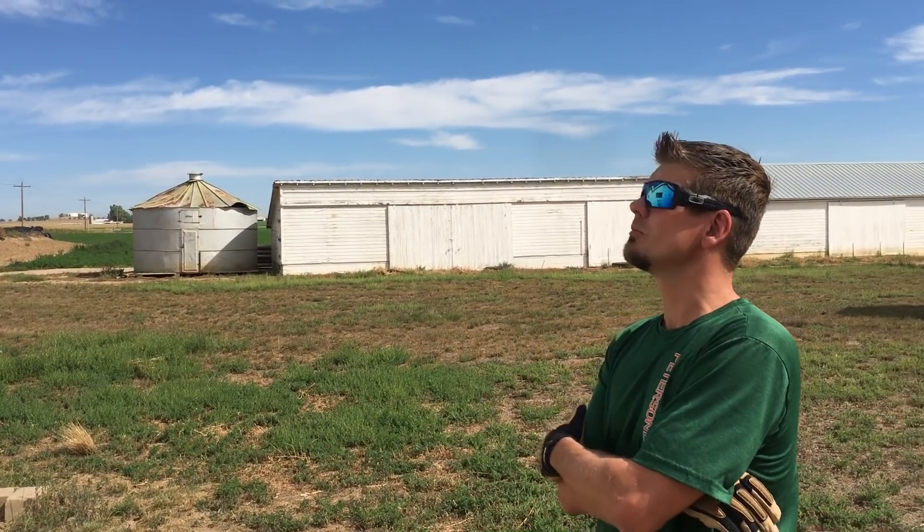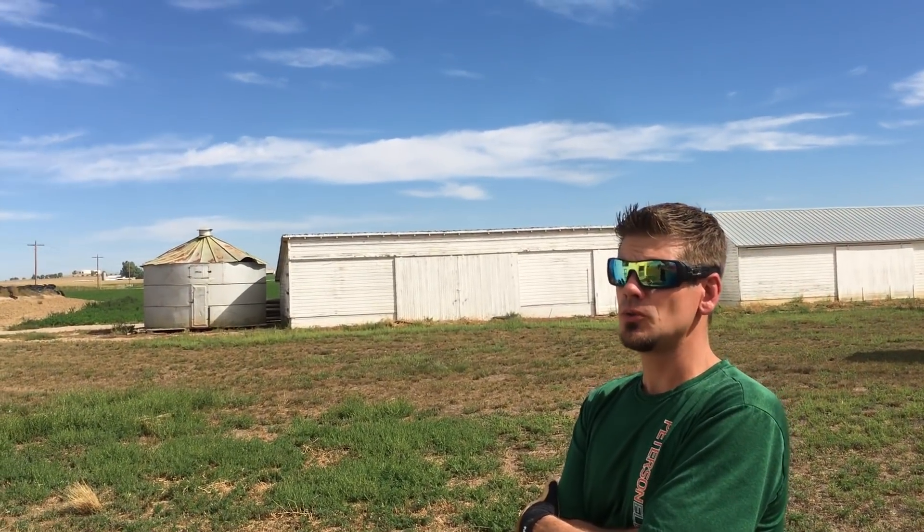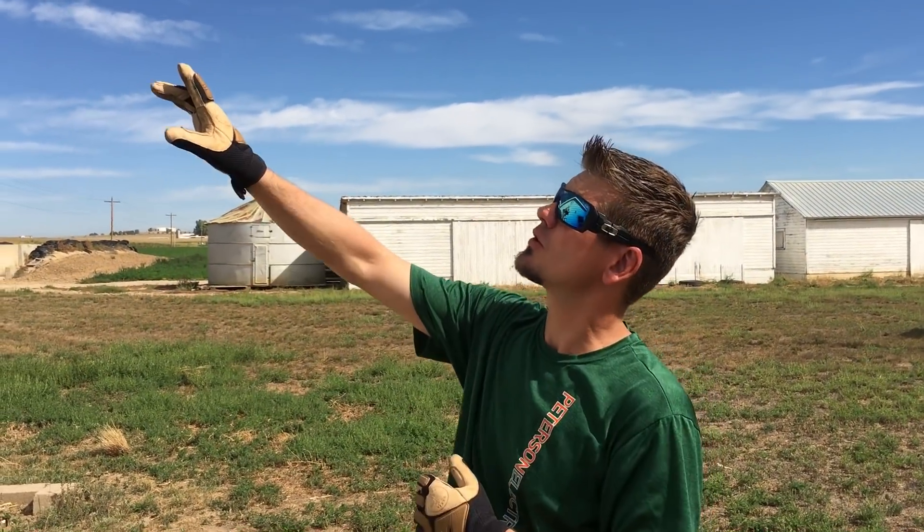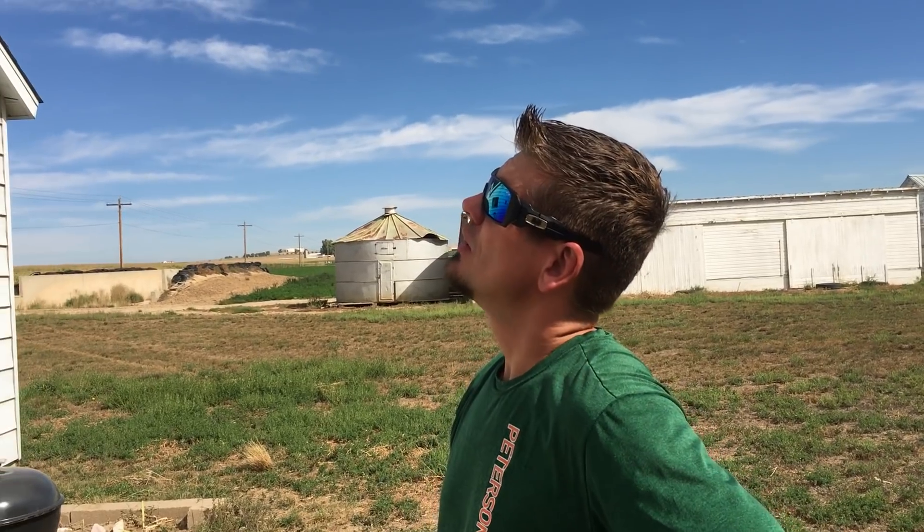So right here on the side of this house, we've got to figure out what to do. My suggestion for this gentleman is to probably do a total gut — redo the house, all knob-and-tube, with some of the oddest wiring down there with the splices. Right now we're going to try to figure out how this is energized. The next thing I'll do on a video is probably a continuity test. Alright guys, thanks for joining us.